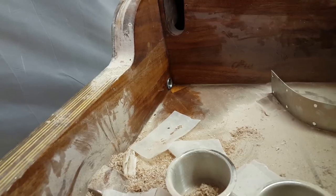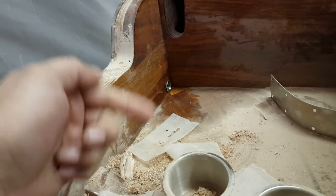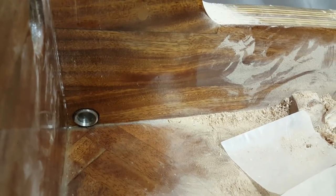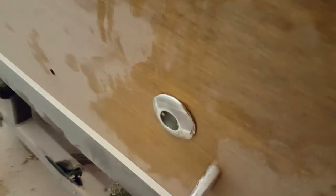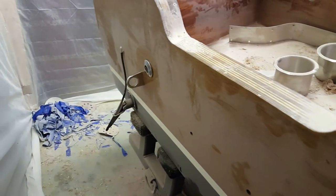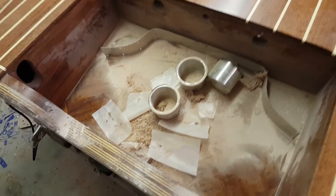Because the wet epoxy was still in the hole when I put the wood flour thickened epoxy on the bulkheads and slipped them in, it's going to make a fantastic seal all the way around. I chamfered the inside edge of those stainless bulkheads to give a nice funnel shape to aid water running out of them. They're nice and sealed up, look pretty good. On the outside of the transom they are nice and flush - just look really really good. Our motor well drain through-hole fittings are permanently installed in the transom.